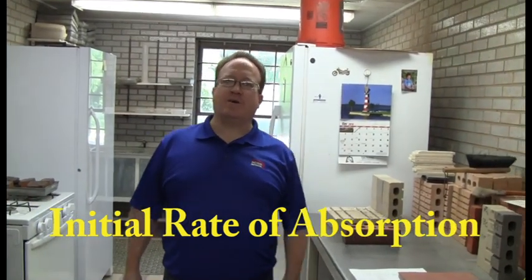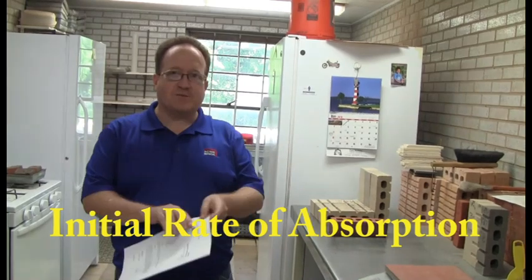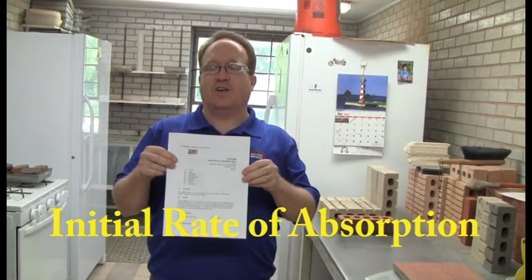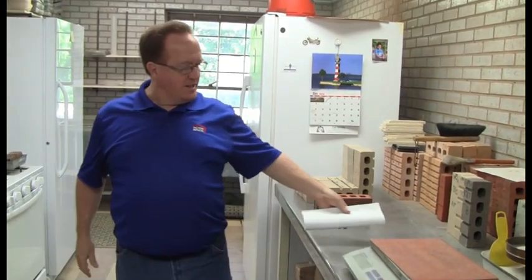Today we're going to talk about the IRA procedure. Of course, like all of the Acme test procedures, you can find it on the intranet under ASTM test procedures. The main reason that we do the IRA test is it's kind of a test that helps the brick masons out. Kind of indicates what kind of bond you're going to get with the mortar out in the field.